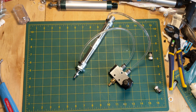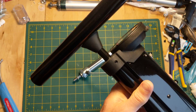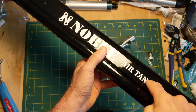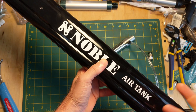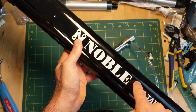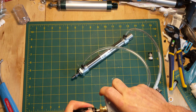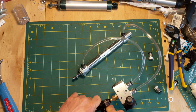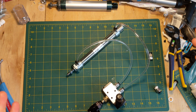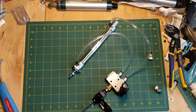The last thing is the source of pressure. You could use any air compressor, but I found this bicycle pump on Amazon that was especially good because it has an air tank built into it. It's designed for a bicycle tire that needs air released quickly — you pump it up, it stores the pressure, and releases it when you're ready. It works great for driving these cylinders. You could also use any compressor for blowing up a tire, or even an old bicycle tire — blow it up, connect it to the pressure port, and run it until the tire is flat.